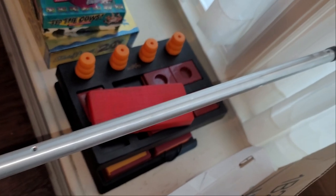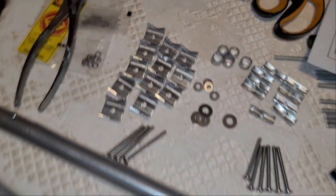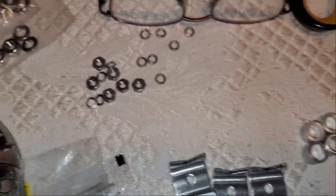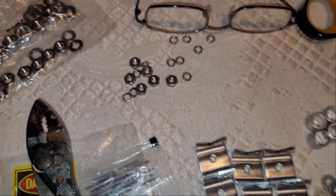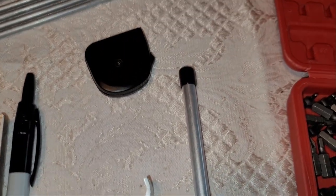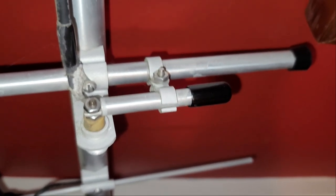On this side again, it's 19 inches between the first set of holes — that's sort of your left and your right. Now I laid everything out, counted all the parts, checked against the master part list, and it looks like we're short some parts. It's these little 8-32 nuts. We have plenty of washers, but we don't have enough nuts — about half the number we're supposed to have. So I'll make a trip to the hardware store to pick some up. There's the connector assembly and a little tuning rod that comes with the Cushcraft antennas. You can move the main tube assembly up and down to help tune and get a gamma match on the antenna.